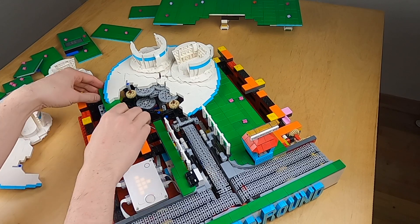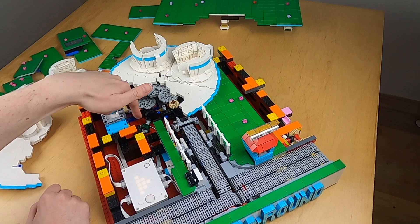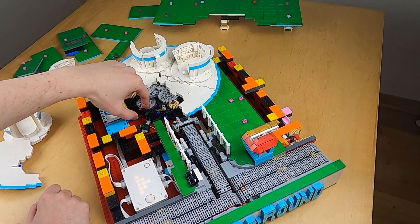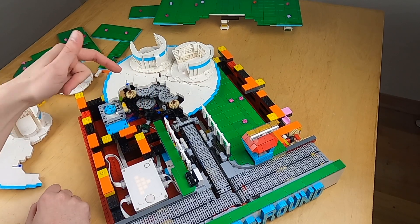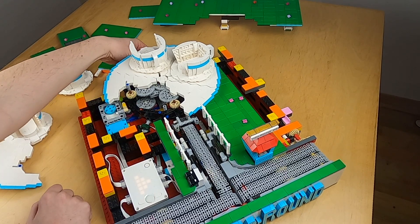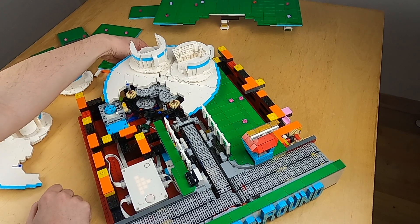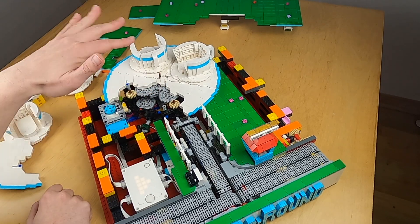So the big motor I have here — let's just take this plate off as well. The motor is geared underneath here to this big gear, this 40-tooth gear running inside of the banana gear, so that's a 40-to-140 gear reduction. The gear here in the middle is actually staying fixed, or really I can adjust it using a gear here on the back in order to make small adjustments to it. But it was just so nicely adjusted — now I just broke it.